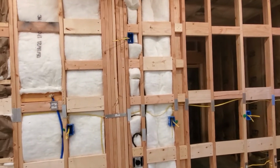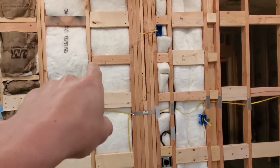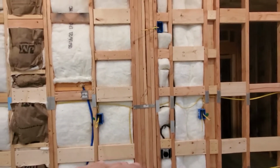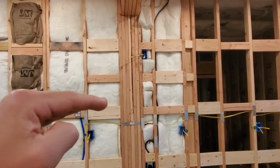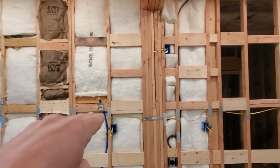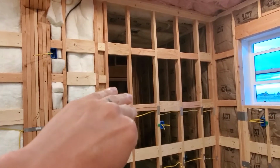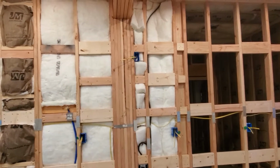And the one thing else that you maybe noticed was that I have a 4th row over here. So I have a 4th row with the center line at 70 inches over the cooktop. That's because over the cooktop, we'll have the microwave with the vent hood, and that actually doesn't come down as far as the lower cabinets. So the lower cabinets will kind of follow here, and then they'll kick up, and they'll go across this way, and then they'll come back down and be lower cabinets.